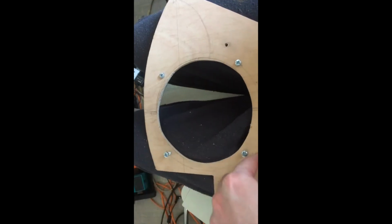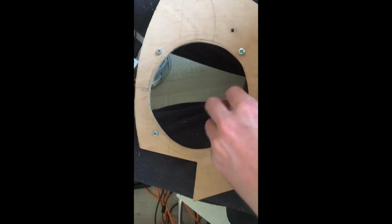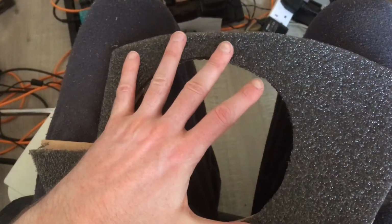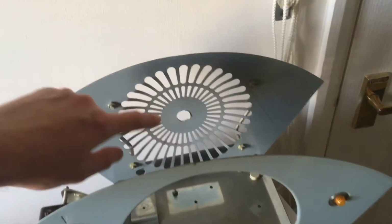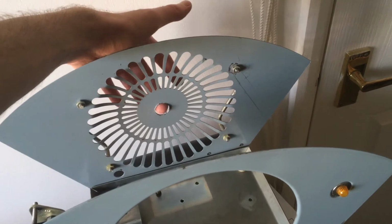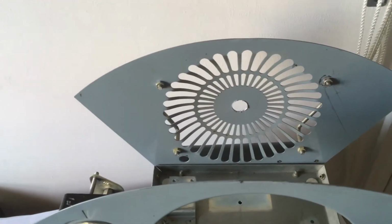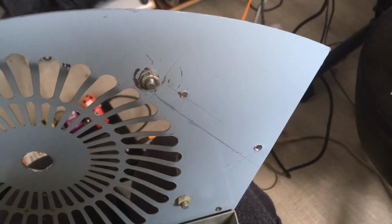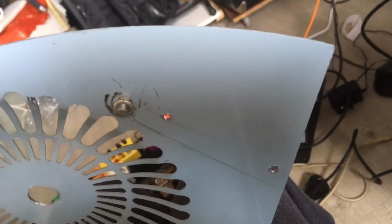In order to stop the ply speaker template rattling around inside the fan chassis, I added some extra insulation using some old floor soundproofing insulation foam. I drilled a hole in the centre of the back of the fan chassis for the power lead to fit through, as I found the old power lead hole was already the perfect size for the speaker out socket, and the new power lead hole needed to be bigger. I also drilled the holes for mounting the MV50 inside and then put it all together.